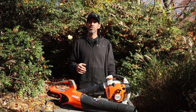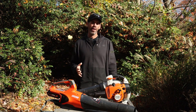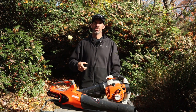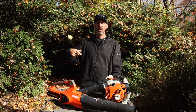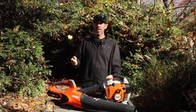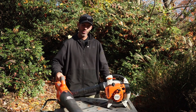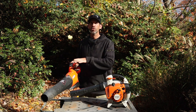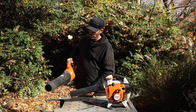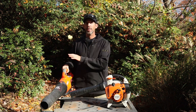One thing to mention about both of these blowers is how the air coming out torques the blower. If you've never run a hand blower, they're very rough on your wrist — when you pull the trigger, they torque to whatever direction the motor is spinning. That fan propelling the air torques right or left, so you're constantly fighting it with your wrist. With the E-Force, the torque is straight line — front to back, always a rearward shove. It's nice, straight line, comfortable power.